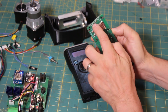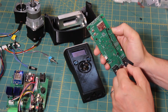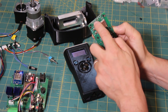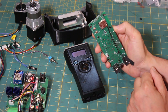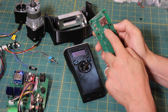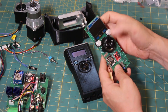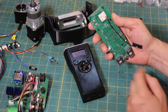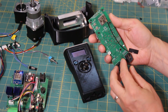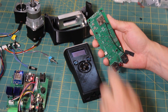There are map LEDs up here where you can adjust the intensity for map reading — that's what they've always been called, for reading maps while stargazing. You can adjust the brightness of these, and if you solder this jumper pad, the button LEDs will follow the brightness commands of the map reading LEDs.